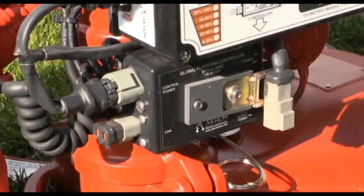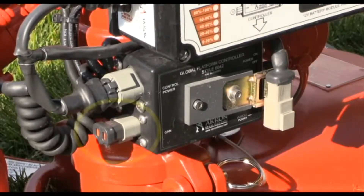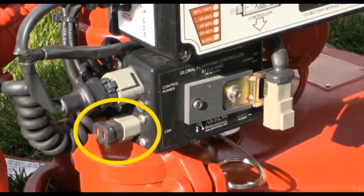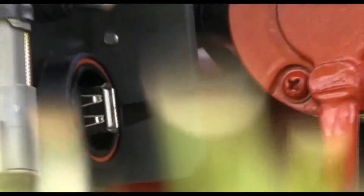The Apollo PE utilizes a fully sealed onboard control system integrated into a harness with a wireless control built in. A J1939 CAN port is also included to accept any of our CAN compatible joysticks or toggle switch control stations. A USB port is also standard for easy updates in the field.